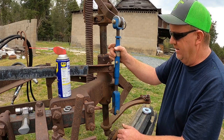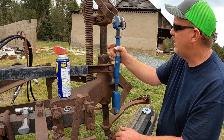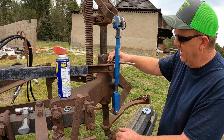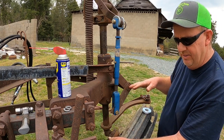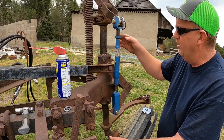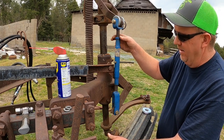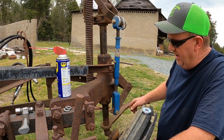I've just got some washers in there for right now. Once I get it in the dirt and try it again, we'll see how that goes, but I believe that'll work. When I took it loose, I had to manually push down on the plow body and the discs are about the same distance off the ground right now. So I've got it pretty much set where I need it. You can lock it down here and raise the body up and down. I believe that might take care of one of the major issues — just something as simple as taking a few cotter pins out and putting this top link in there.